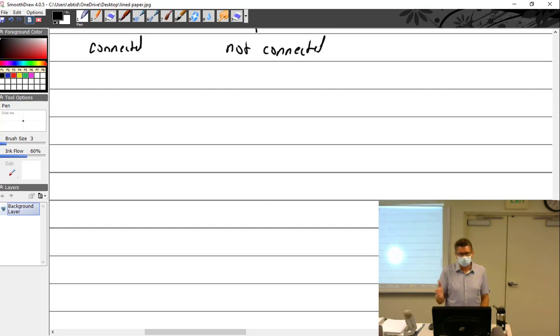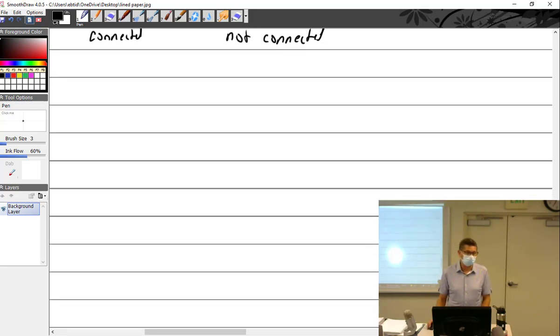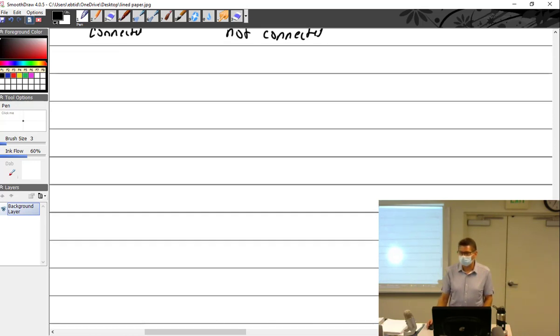If there's any ambiguity and you misread it, you're burning up something or causing damage. Whenever you are actually drawing up stuff like this for aircraft, it usually means that you're doing some sort of major alteration or repair. Otherwise, why would you be drawing it? It's already in the manual. You just follow what the manual says. But if you're adding something, you're changing something, which happens a lot in aircraft, then you're going to make a drawing. What happens to that drawing? It goes on a form 337, an FAA form 337 that is sent to Oklahoma City and made part of the permanent aircraft records.